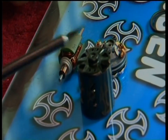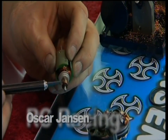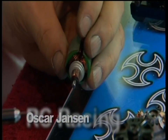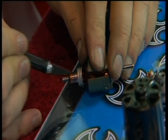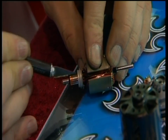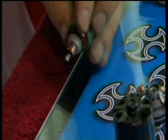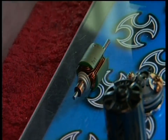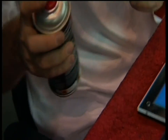So this is a motor that has just been used. You can see the commutator has a little spot here and this just needs to be cut to get it in perfect condition again. The first thing I normally do is clean the splits in between a little bit, because sometimes there is some hard carbon fibre which you need to remove. Then you take the motor spray to clean it a little bit and make it wet before you start the cutting.